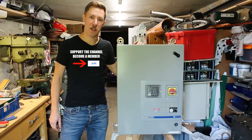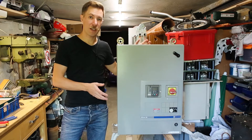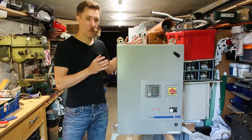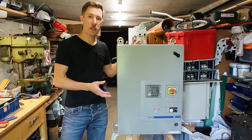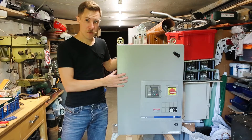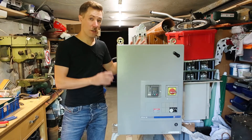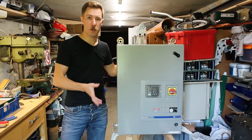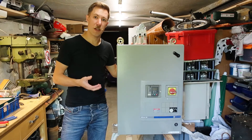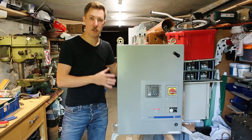Hi all, my name is Maz Bahnkop from Kaiser Power Electronics. Today I'm here with a pretty special Telemecanique Altivar 58 frequency inverter. The special part about this is the dust-safe enclosure, which means that the heatsink with the airflow to that is actually sealed out from the electronics inside this cabinet. So it is a rather special unit — I have actually not seen this before. Usually we would just install the frequency inverters in larger cabinets or in separate rooms away from contaminated environments, but this is actually built to be mounted in a dusty and contaminated environment.